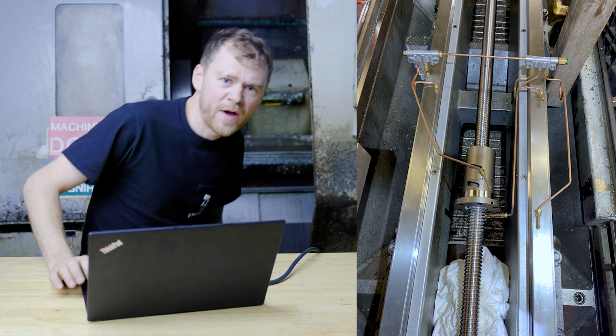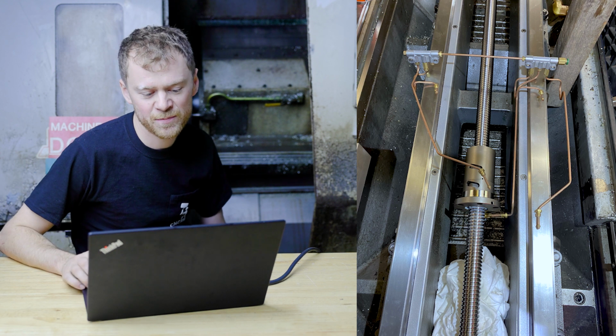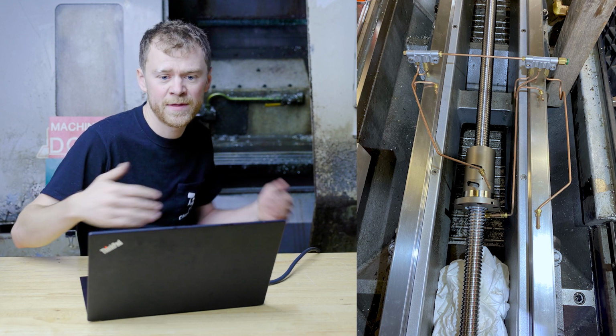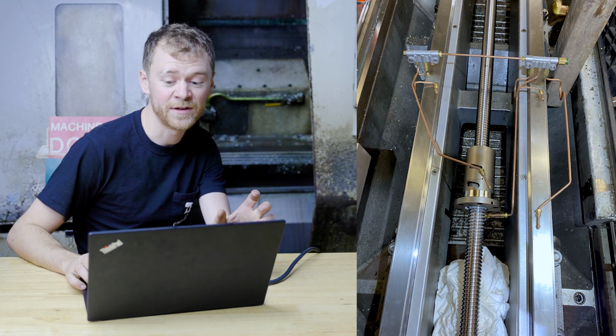Okay, got wedge, turret, Y, X, spindle square. Let's deal with the sub spindle. New rails, new lube lines actually, they were hosed. Remember, they were totally bent. I wasn't gonna try to fix that. And a new ball screw that actually feels nice.